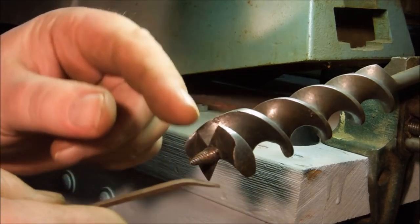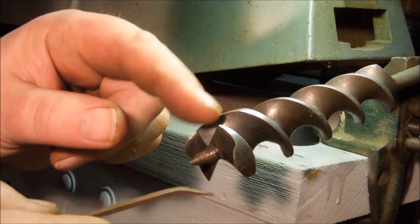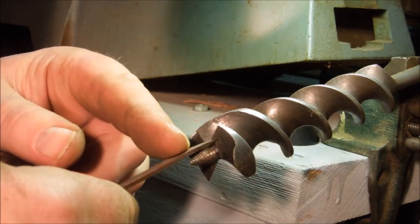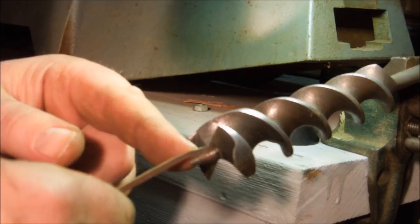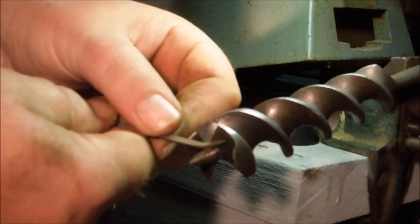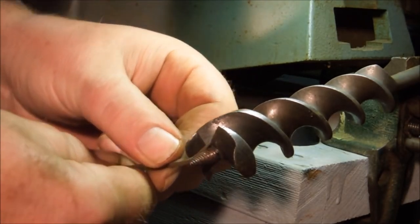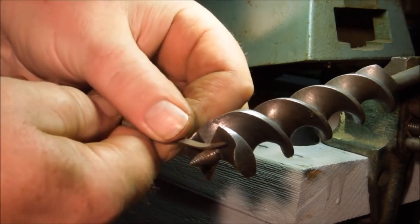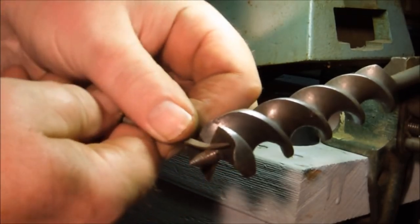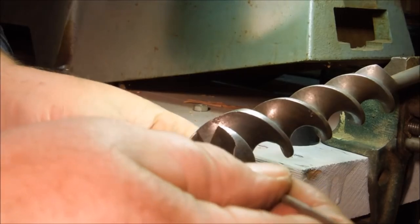So as this is turning, this can't advance because this shoe, or this radial cutting edge with the sled underneath it, is acting like a shoe and jacking this thread right out of the hole. So it'll just strip that pilot thread right out. So we want to make sure that these threads are good all the way up to the radial cutting edge. And it's funny, but I find more of them with this part of the thread damaged than with the points damaged.